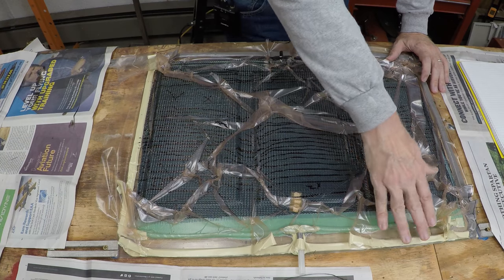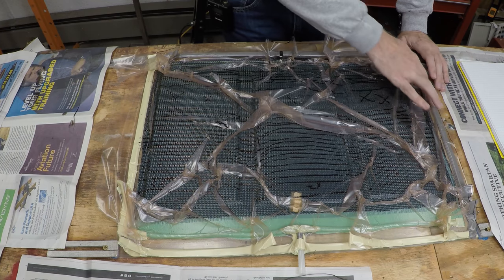I'm going to wait another seven hours before I pull the vacuum bag off of this part. I'll videotape pulling the vacuum bag off and we'll see how the tacky tapes compare in how hard it is to pull off of the mold surface. So in YouTube time, I'll be right back. It's been seven hours and now we're going to take this vacuum bag off and compare the traditional tacky tape to the Home Depot butyl tape to see how well they attach themselves to the mold — in other words, how hard is it to remove the tape from the mold surface.